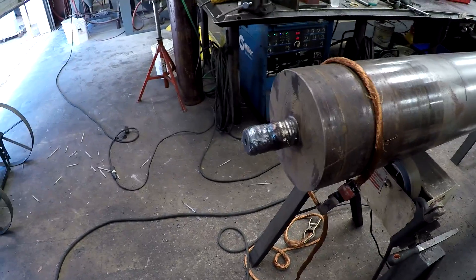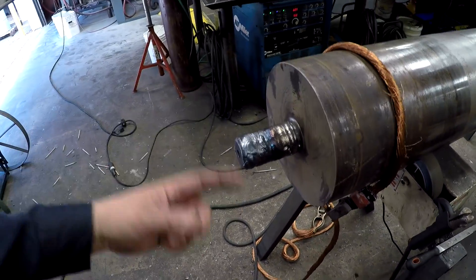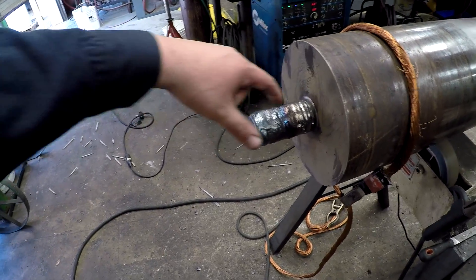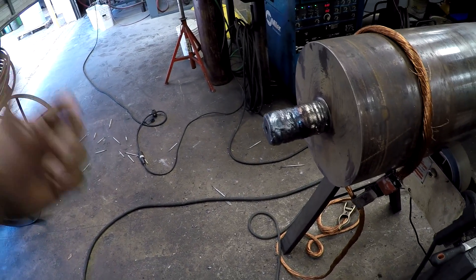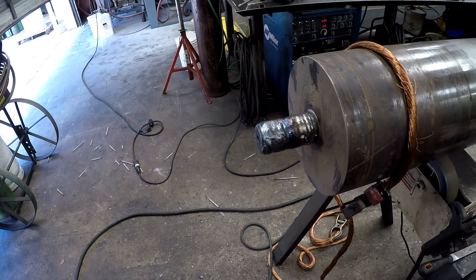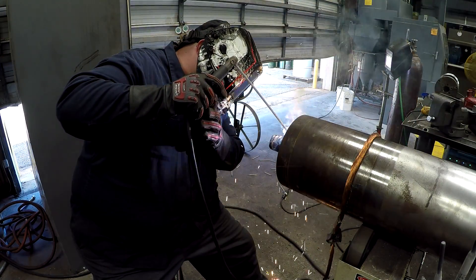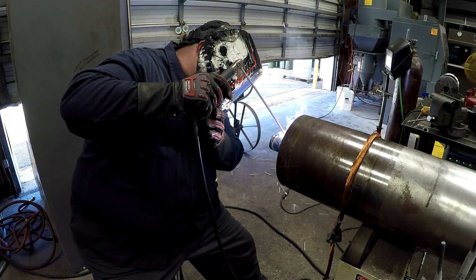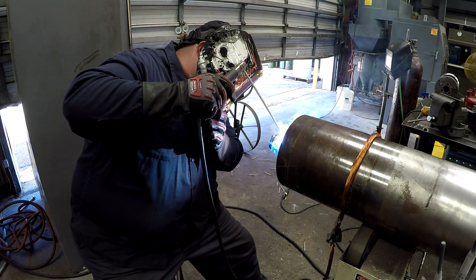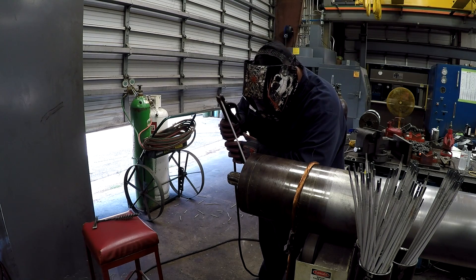There it is, completely welded up. But I'm going to make another pass around it because I'm afraid it's not going to be built up enough. So we went around it this way, and now I'm going to run some stringer passes all the way down the length. That should tie in all of the little valleys in between the weld beads. When I go to turn it, I shouldn't have to worry about running into any little low spots that don't clean up in the weld.